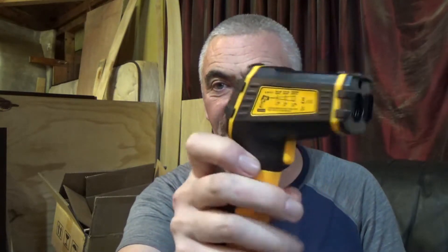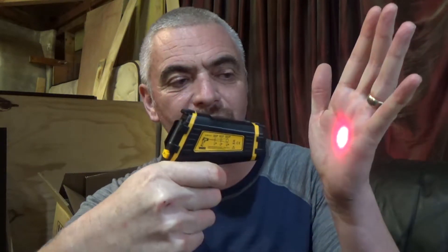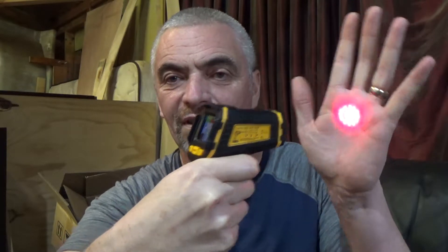Just a few of those to try them out because I wanted to have a few different switches. And something else quite neat — this here — it's a little temperature gun. I've wanted one of these for a while. I actually wanted the next model up which goes to like a thousand degrees for playing with the pizza oven, but they're just a bit expensive and these are very cheap. You shine it on something and it comes up with the temperature. I actually plan to use it to check all my electrical connections, just looking for hot spots that would suggest a higher than normal resistance.